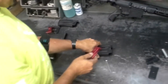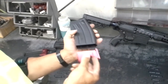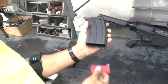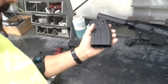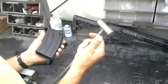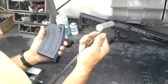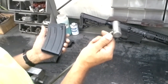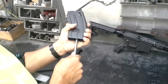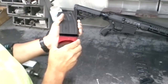One thing to keep in mind: this mag seems to be pretty good, but sometimes you'll get them where the follower is pretty tight right down here at the bottom. If that's the case, it's a good idea to slightly spread that just so the follower passes through easily. We made a little tool that we use here in the shop, basically mimicking a little bit larger than the diameter of a 12-gauge round — this one is .84 inches in diameter. A deep well socket will also work if you can find one about the right diameter. You can push that in there to slightly widen the magazine and get the follower to slide in and out easily.